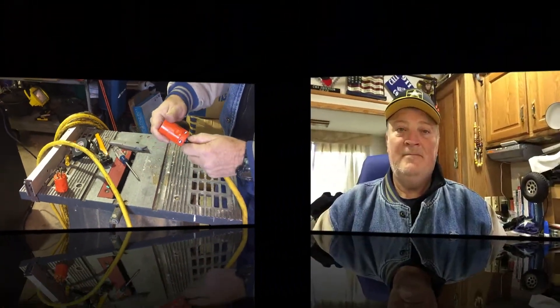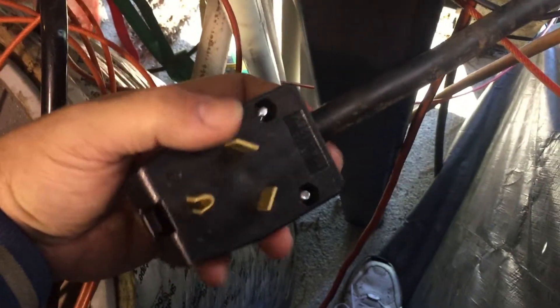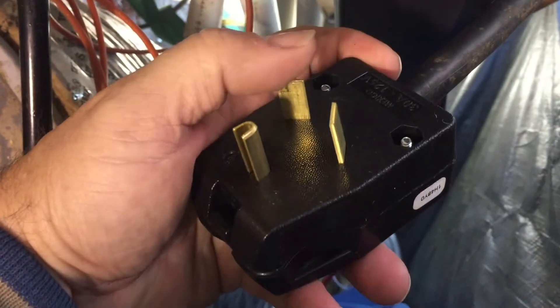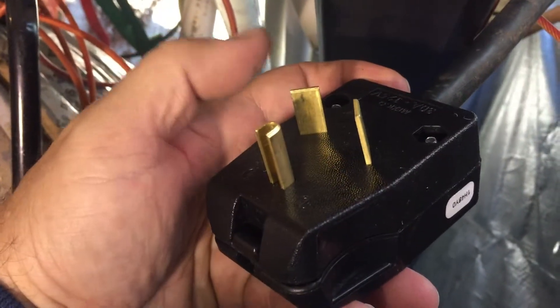So there you have it. What's the point of all this? My point is, don't waste your money buying a gigantic extension cord that only does 15 amps. Go ahead and make your own if you want a larger amp draw, such as to a fifth wheel. If you want a 30-amp draw, don't use 15-amp plugs. This is an example of an extension cord that I just built — it is 8-gauge wire, and it has very large blades. It's 110, but it's capable of up to 30 amps, which is what my fifth wheel is — maximum capacity is 30 amps.